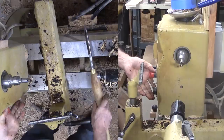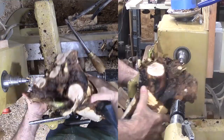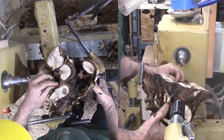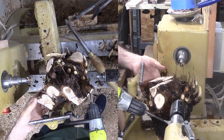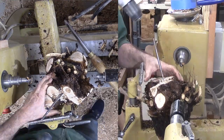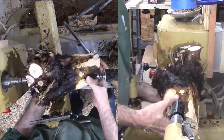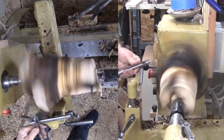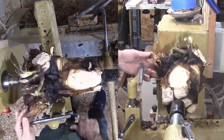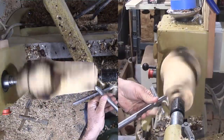But the wood wants to escape. The drive center is not on wood that is very solid. I drilled out the spot for the drive center down to more solid wood — there is no totally solid wood in this block. Then I continued to rough around the block with my large bowl gouge. I am starting to believe that there is some sort of vase inside this wood; it is just not easy finding it.